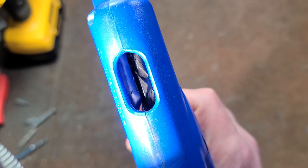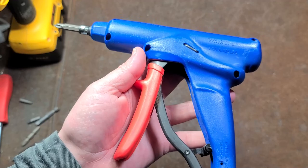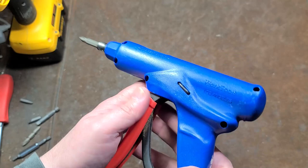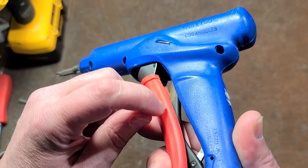It has a diamond or cross-track rod — the same mechanism found in those old push screwdrivers and push drills, things like the Stanley Handyman. They're using a push screwdriver mechanism with a long cantilever bar that grabs the rod and actuates the push-screwdriver mechanism to give you a powered screwdriver action.